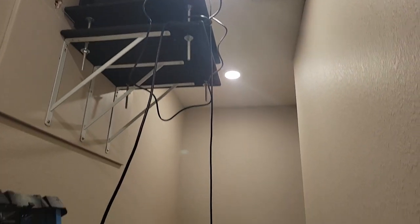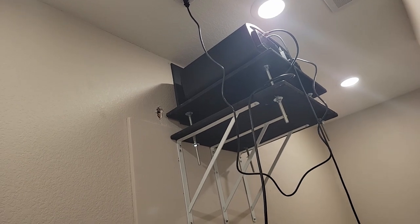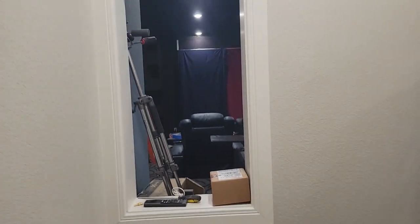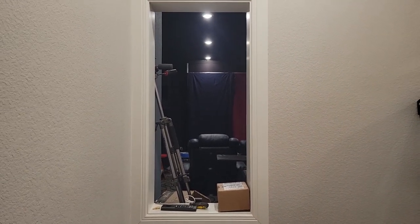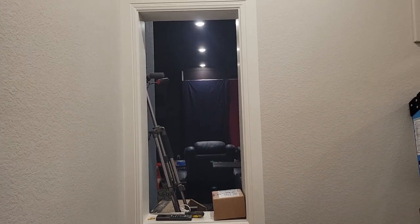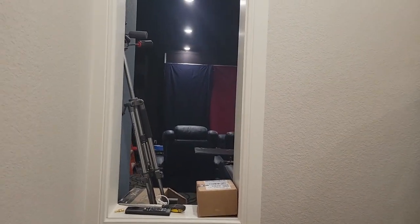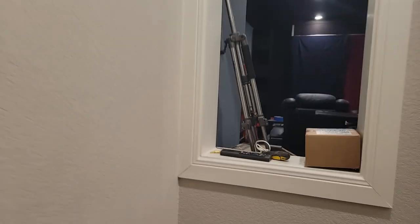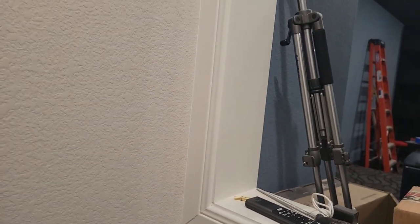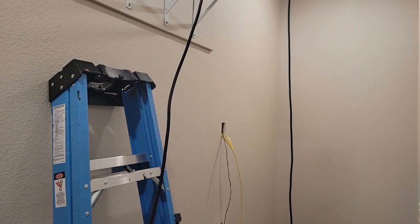It's actually connected to power right there. We've got an HDMI cable just kind of dripping down here, but I've got a hole cut and a way to get the wire from there all the way down. This is where I was originally planning to have all the front-end equipment facing into the theater. I decided to cover that up, sheetrock over it, and then decided not to do that. I'm going to instead fill that with rockwool — maybe some kind of a frame and grill cloth on the other side of it and on this side. There's about six inches there — I could put two more inches on each side, have eight or ten inches of rockwool there.